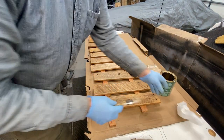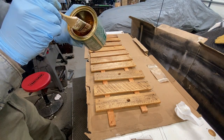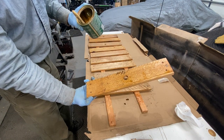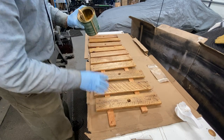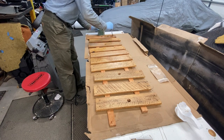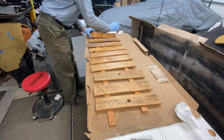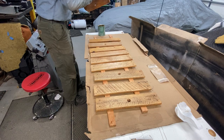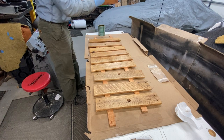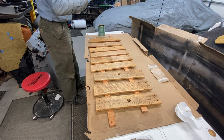We're back. I let these dry overnight and I think I've got just enough varnish to do one more coat. The bottoms are still a little bit wet but I think I'm just going to leave that single coat and hit the tops. I'm noticing this varnish — even though I put a bag over it overnight — has skinned over and left little chunks, so I'll be picking those off.